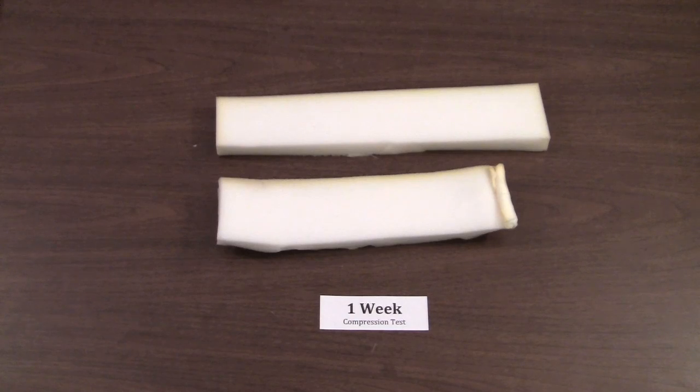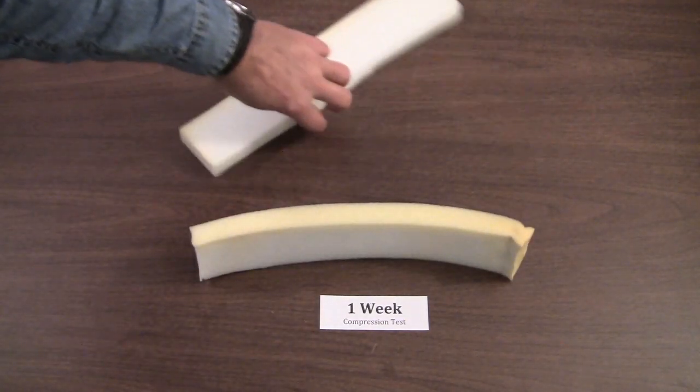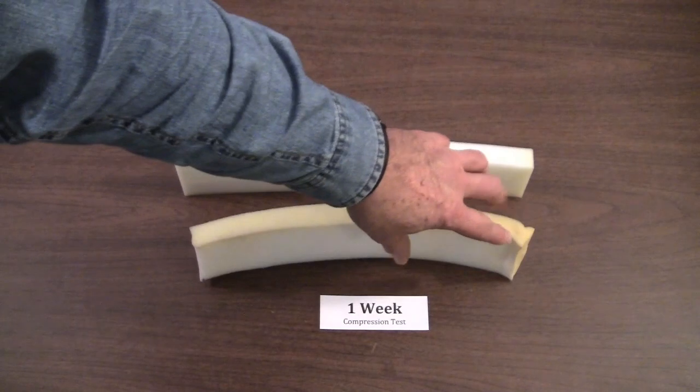You can see it's still very slowly uncurling. I've edited out about six or seven minutes of footage — you'll see a pop where the cut occurs. I do that again because there's another little pop at the next cut, otherwise you'd just sit here watching foam barely move. There's the last unroll pop as I've cut time out. Put it on its side — you can see the curl the competitive foam has accepted, while our foam has virtually no curl. Notice the pinching that occurred at the very high compression point in particular.